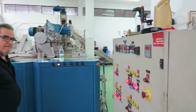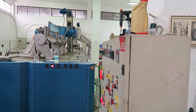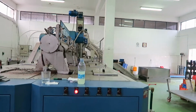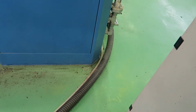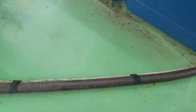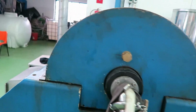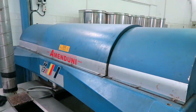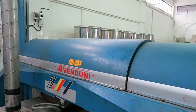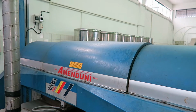So, the olives stay in about 45 minutes in these little cookers, containers, furnaces or whatever. And then what happens is that the mixture comes down this pipe with a little bit of water and goes into here. Now, this is effectively a big centrifuge. It spins the whole lot, it separates the water, the oil and the solid matter.